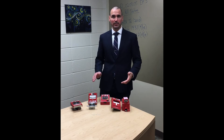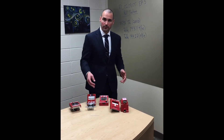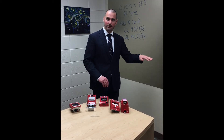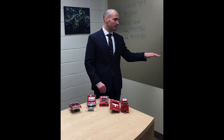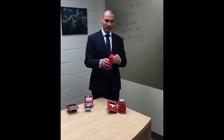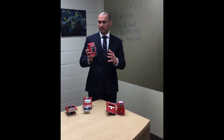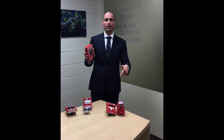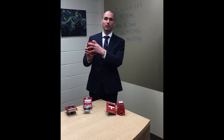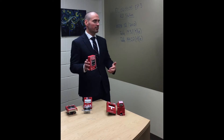This is often missed by healthcare facilities. Why are we doing an inspection for these devices? The main reason is they're right at waist level — a little bit higher — but they're hit by carts all the time. You'll see them dangling, falling off, just broken. Drew actually had to fix one last week — we'll post a picture below — the entire cover was just ripped off. So you have to do inspections of them semi-annually. If that's not in your CMMS system, go ahead and add it.